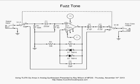And as I said, this is something that you could put on your workbench this afternoon and be playing your guitar through. Well, let's look at what's going on here. Well, we're feeding our input to the non-inverting input, okay? So the input's coming from the jack. It's being dropped across this 100K R1. We're going through this 0.033 microfarad, and in this particular instance, that's not a critical value. That could be 0.1, it could be 0.05. We're dropping then on this 1 meg R2, and then that signal is being applied to the non-inverting input.